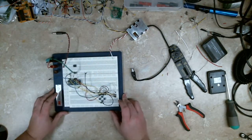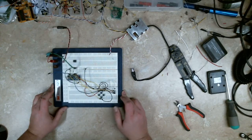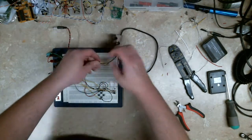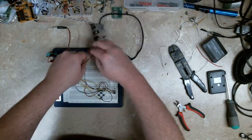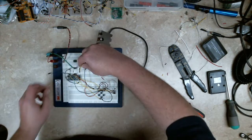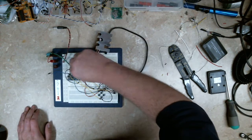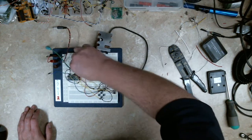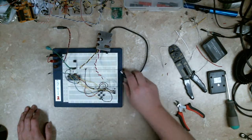And this has got the Hackvision Arduino circuit from yesterday. And this will make more sense too. See what I'm doing here. These two bus lines are ground and video. So I'm going to put the yellow wire into the video bus and the ground wire into the ground bus.